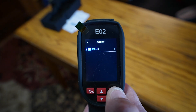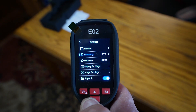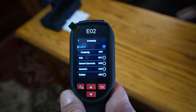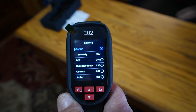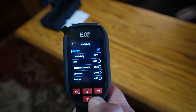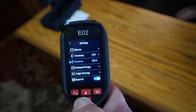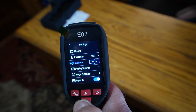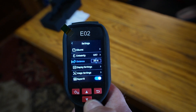So we hit the back button to go back into the main menu. Emissivity — it's a tough word — is basically the amount of energy different types of material give off. By default it's set at 0.97. I would just recommend leaving this as the default, though you can fine-tune it depending on what you're using it for. Going down to distance, I've got it set at 2 meters, which can be adjusted — it comes by default at about half a meter.